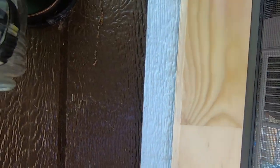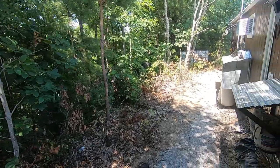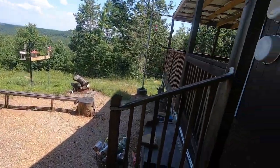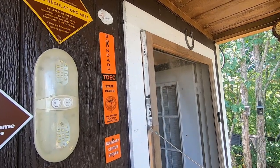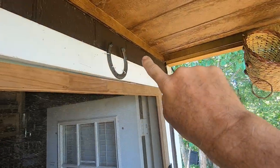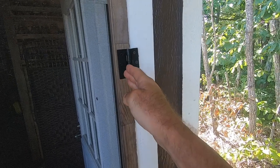Let me help you visualize it. What I do is I frame this out using furring strips and build the door frame out. Let me show you what a finished product looks like — let's go for a walk. You can buy a screen door for a normal house that just goes right in, but this isn't a normal house. This is actually a tool shed converted to a tiny home cabin. Here's what one looks like — see how it fits right in there, and those are the furring strips. Then I come out and build it out, use the hinges. You can find a hinge kit in the hardware section — it comes with a spring and a handle.